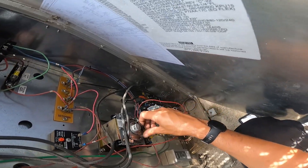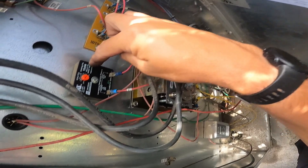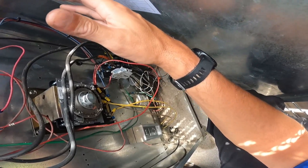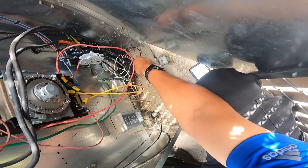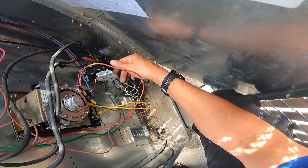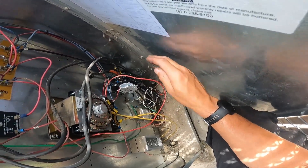That's all I got — this is easy stuff. In the panel I've got a transformer, a fuse, a terminal block, and a timer. I hate these anti-short-cycle timers, I usually end up bypassing them, but they keep it from short cycling. There's also an A419 thermostat — basically an A19 that's digital. Simple, easy to use. The auxiliary contact probably controls the crankcase heater.